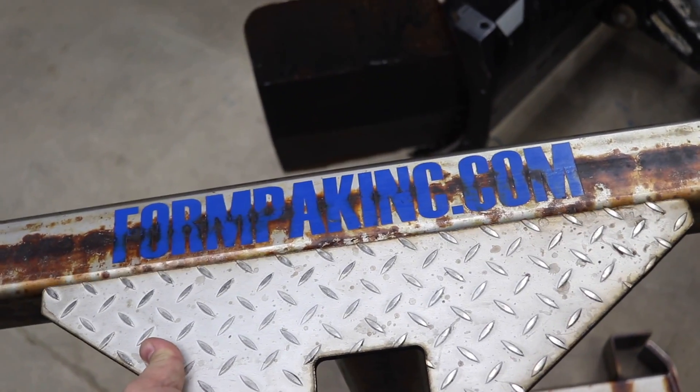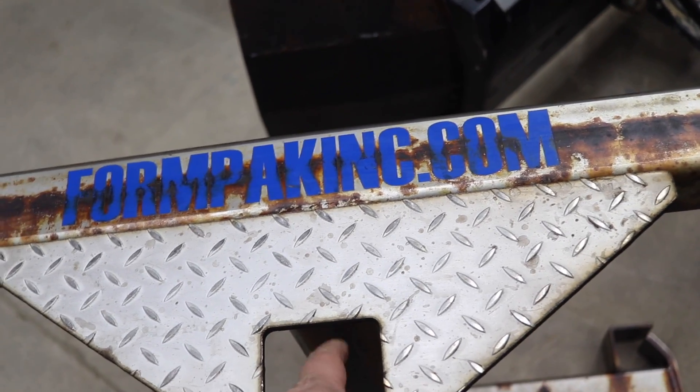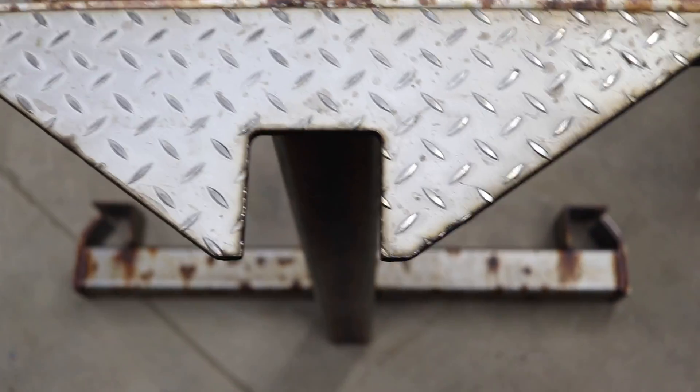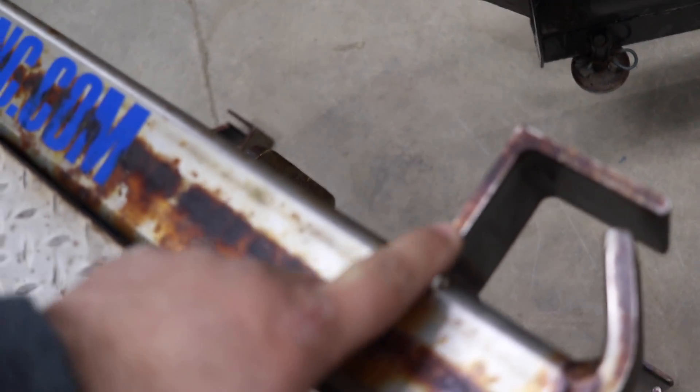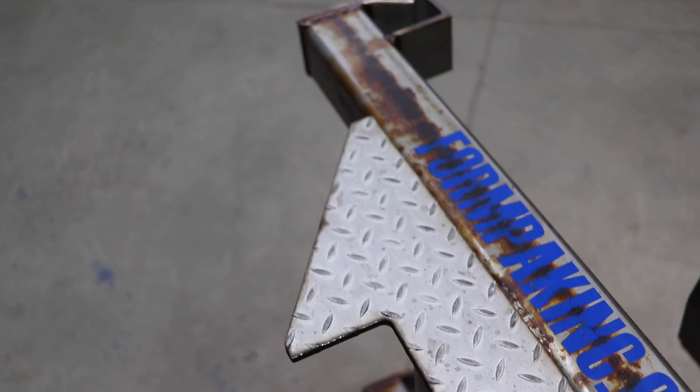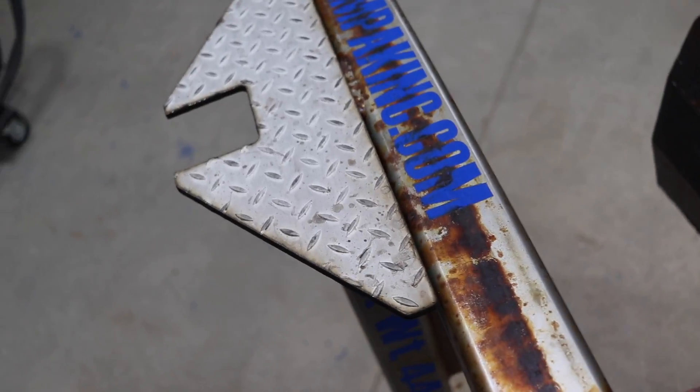We just plasma cut a couple of brackets here real quick. We'll put that thing three inches further down, weld it all on, put two on this side and two on the other side. That's going to be our little stainless job for tonight. All this is going to be quarter inch material or thicker — gauging by the radius, that's quarter inch tubing, three by three quarter inch. There's nothing to it but to do it.